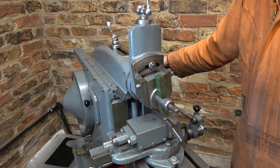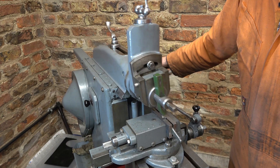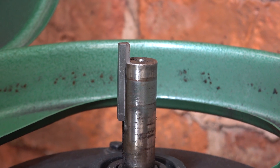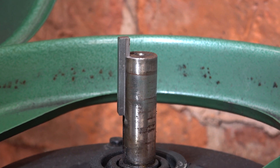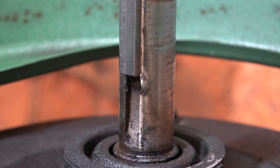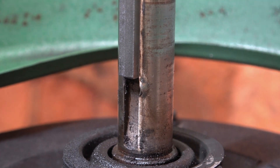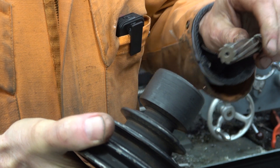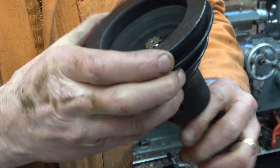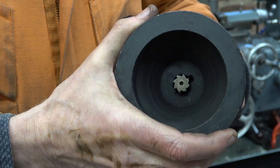Just taking this steady. That fits in there perfectly. I just need to sort out that bit where the shaft was damaged just below the key — just because some lazy person put it together without the key, and then the grub screw forced its way into the keyway. This pulley has a five-eighths bore and a five millimetre key — is that normal? Just cleaning out the rubbish on the inside, trying to get it on the motor shaft.